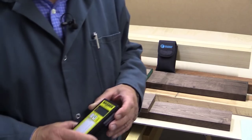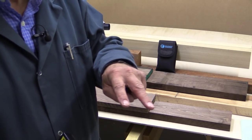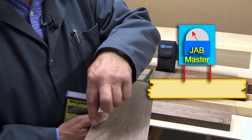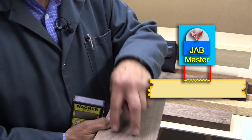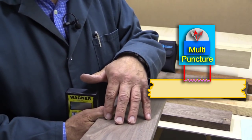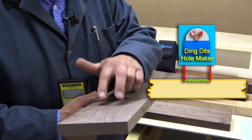There are two ways that moisture meters work. One way, which is quite invasive, is the type with a couple of prongs. You jab those two prongs into the piece of wood — they have to go in a reasonable amount — and then the machine measures the resistance between those two probes pushed into the surface. That may be fine if you've got rough timber that is going to be machined substantially before it's finished. But there are times when you want to measure moisture content at a later stage, after you've given it an initial plane. So that method can be pretty invasive.